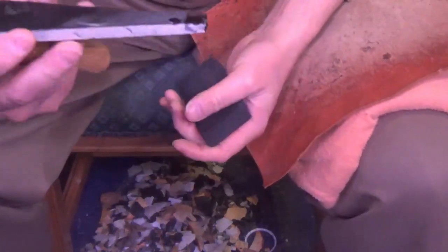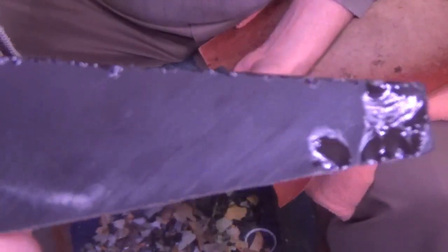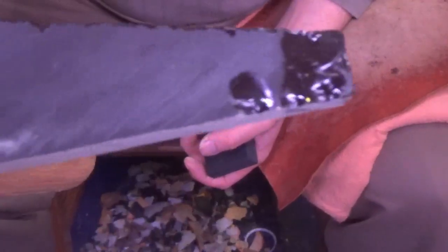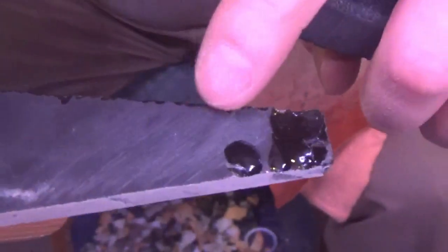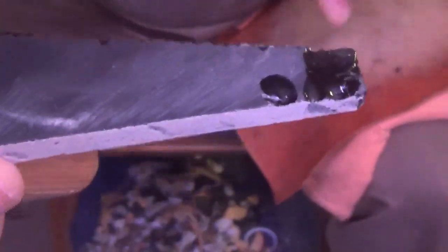When you space your flakes, space them almost to where you think you're not going to feather out the saw marks next to your other flake. Obviously, in the best case scenario, you want to keep them feathered. But what this does is allow me to come back later and take off all those saw marks that are still there and take the flake off.